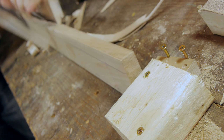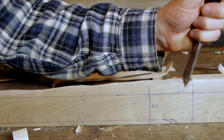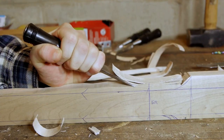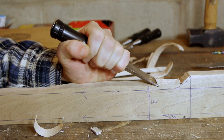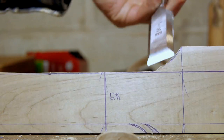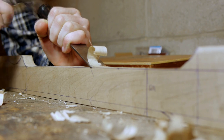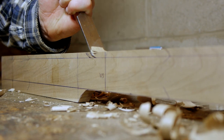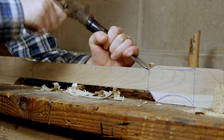It will take a few passes to shave off the bulk of the wood, and as each pass reaches the far curve, it should be cut down a little deeper along the line so the chips break off cleanly where they're supposed to. As we come closer to the parallel mark that indicates the final width of the neck, the shaving should be taken off more carefully so we can come right up to the edge or just short of it. The final smoothing and adjustments can be done with sandpaper after we've finished chiseling out the other side as well as the headstock.